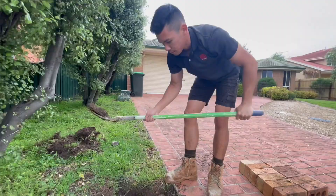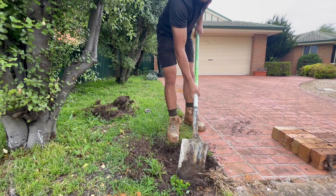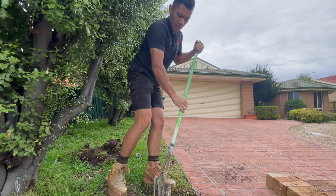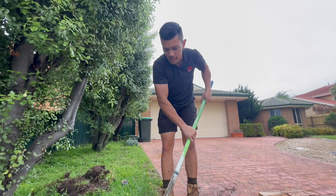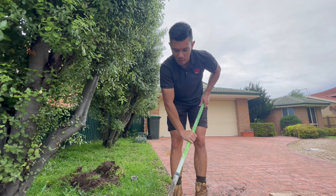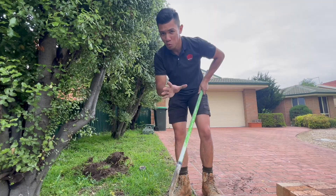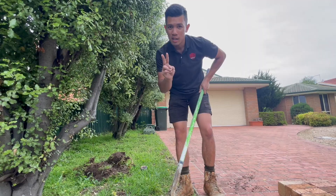I'm digging the foundation so that I can pour the concrete and let it set. I'm going to use quick-set concrete and let that set for about 15 minutes. While I'm waiting, I'm going to move some bricks and plan which bricks I'm going to use to build this thing. It's a 470 pier — two bricks — going up 12 courses. After the 12 courses, we're going to have a miter capping on top, and we'll also be adding those two mailbox inserts that we bought.